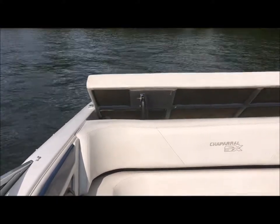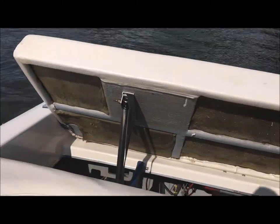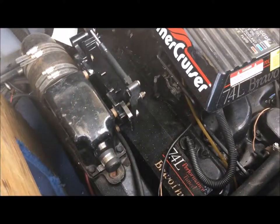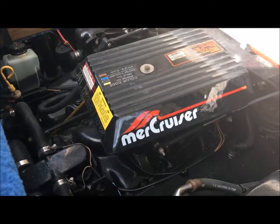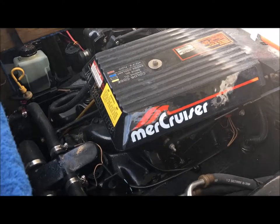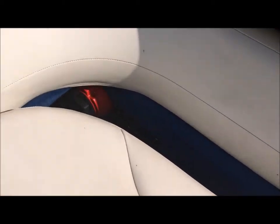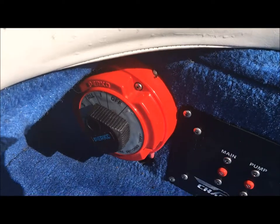Now since we fixed that hatch, you've got to kind of wiggle it when it goes down to get it all the way down. There's our battery switch — as you can see it's running. First thing you do before you put the boat in the water is put the plug in. Then come back here, turn your battery switch to all. The alternator is going to charge all the batteries. When we're done for the day we shut it off. If we're going to sit about listening to the radio, switch it to one or two.